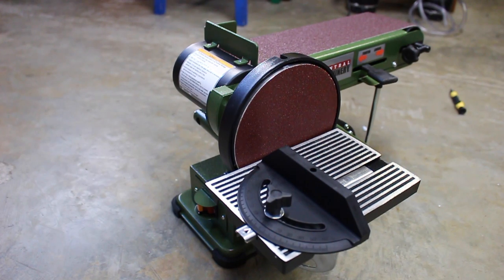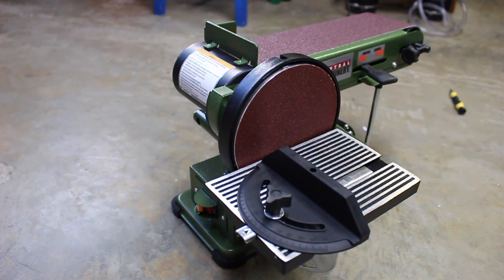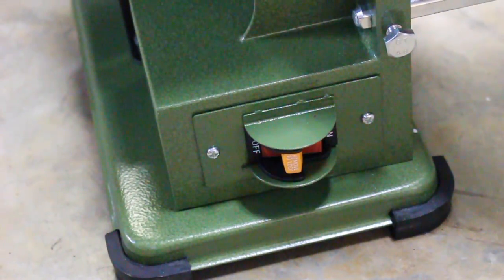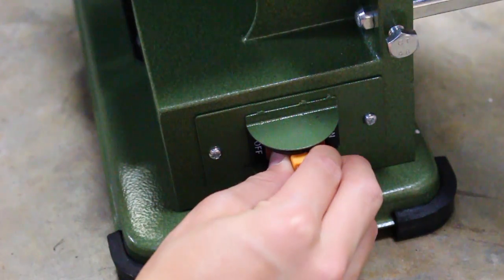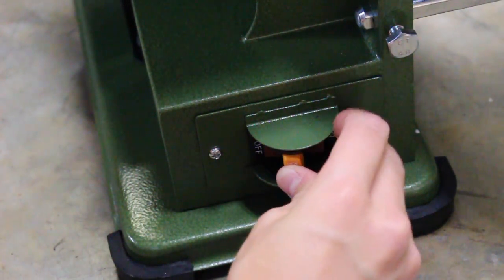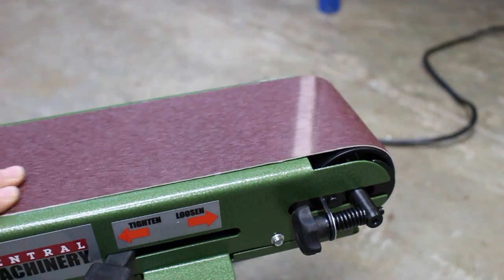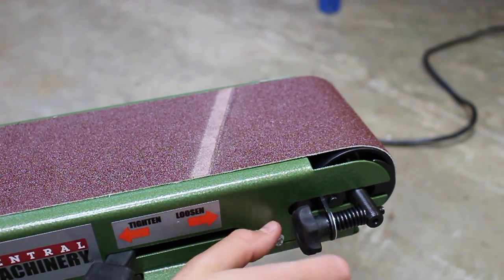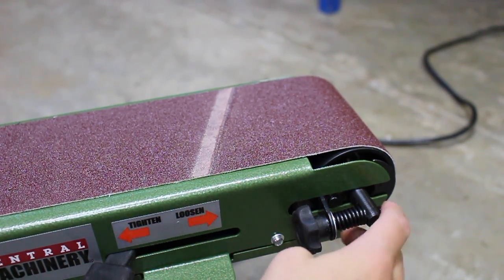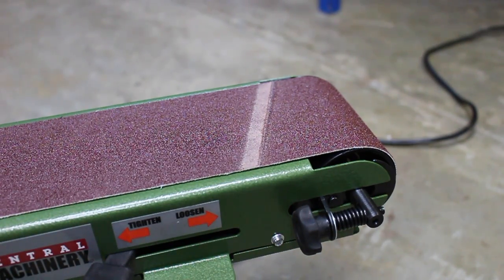Now that we have it assembled, all we have to do is turn it on. But before we do this, please put on a pair of safety glasses — nobody wants you to lose your eyes. And make sure when using sanding tools or grinding tools, never to wear gloves, because if they get sucked under there your hand will probably go with it. To power on the belt sander, use this safety switch here — make sure the yellow thing is pressed in, because if it's out or partially out the switch is disengaged, but as soon as you push it in it powers on. When you power up the belt sander for the first time, your belt will likely start drifting in one direction. That is why they have this knob — if you turn it clockwise or counterclockwise it'll adjust the tension. Move the belt by hand and get it centered as much as possible, then you'll be able to click it on and it won't drift.